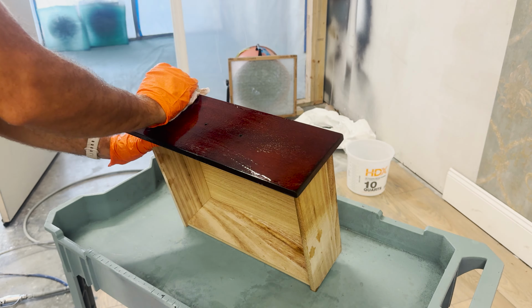So here's that surface after polishing it, and maybe it's not as good as a lot of automotive geeks out there are used to, but I'm okay with that. It's got to be good enough, and I think even after cutting and buffing this, it's pretty much shinier than just about any lacquer you're going to find out there. Even lacquer clear over vinyl sealer just doesn't get as shiny as this automotive paint does.